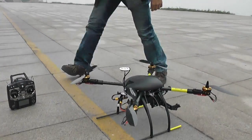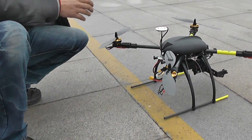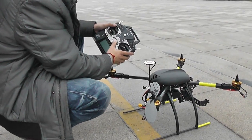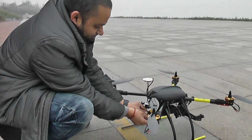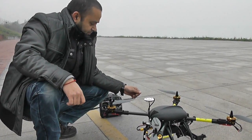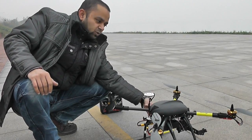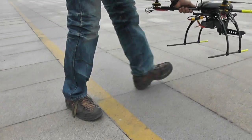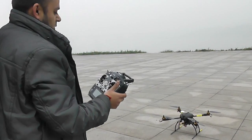Your compass calibration is done. Turn the power off, wait 5 to 10 seconds to be on the safe side. Turn on the radio, turn on the power, and wait. Make sure all the satellites have been found once again — read the user manual. Once you have all the satellites, you can take off and test all the flight modes. You can even take off in GPS position hold mode.